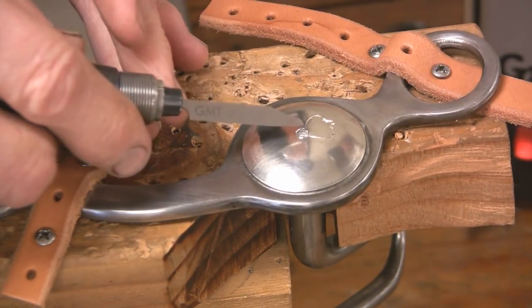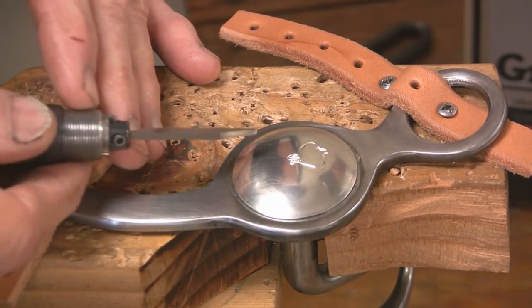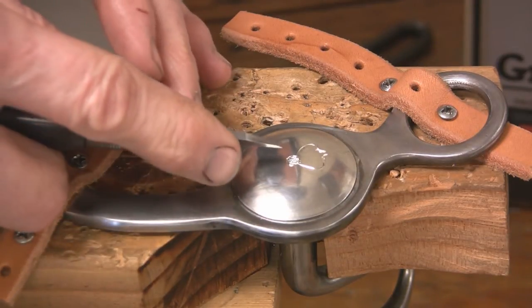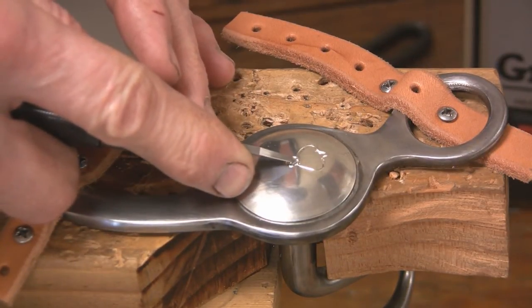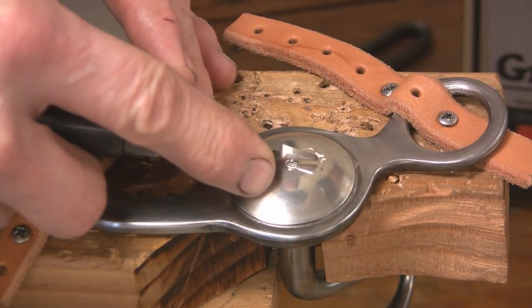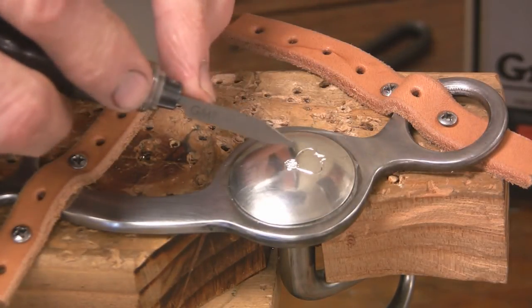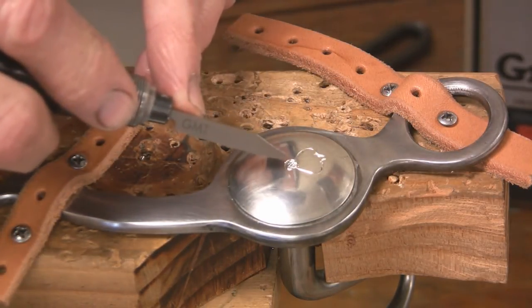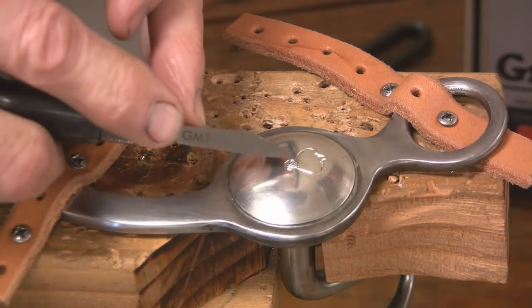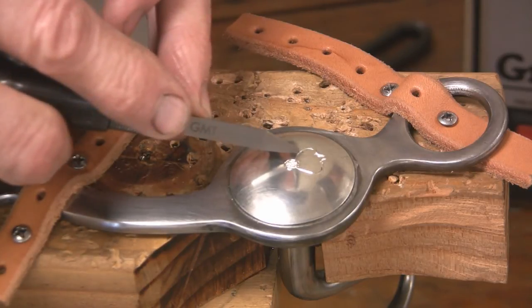I've got the center with the crosshatch, and now I'm coming in here with a number 40 quick change high-speed steel GRS flat graver. And what I've done is started out on the side, come around here, laid it down, and then came out and made a real unique end to that flower on each side. So now all I have to do is repeat this on these other 3 petals here, and then I'll come back with a square graver and put some little fine lines here.